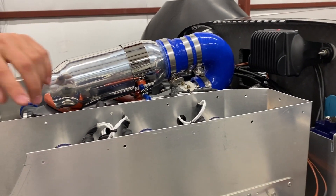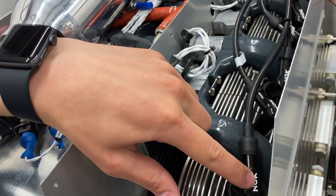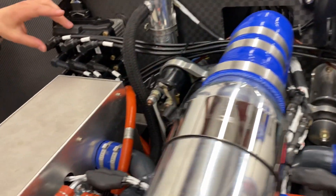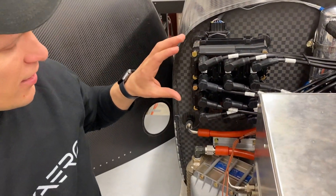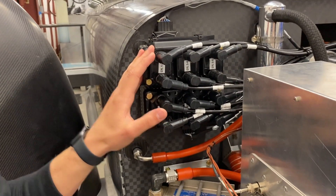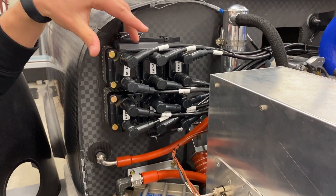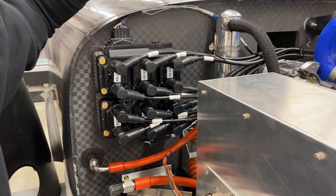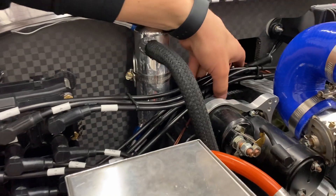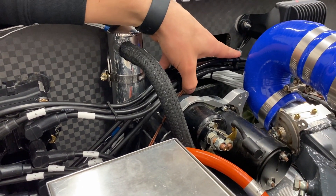Moving across the engine, you can see in the cooling boxes the ignition wires or ignition cables and the spark plugs. Those are fed through these wires and fed by the ignition coils over on this side of the firewall. We have a dual redundant ignition system — two sets of ignition coils. The ignition coils are controlled by the ECU which sits on the cold side of the firewall. One remaining task for the ignition system is to get some clips to constrain these wires running from the other side of the engine so they're not flopping around and vibrating too badly.